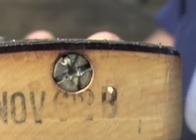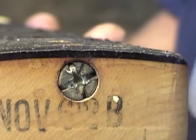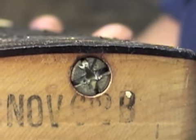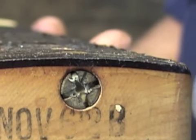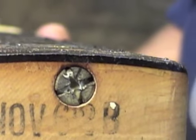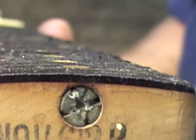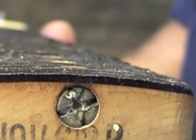Now wood changes shape over the years. This fingerboard was flat in 1962, but under string tension maple really changes shape. So the secret of a great fret job is to have a flat fingerboard with the truss rod off. As you can see, there's no fingerboard on these real Fenders, so you can't really level the fingerboard to get the action perfectly right. So what I'm doing is putting on slightly oversized frets and then leveling the frets to get the fingerboard path perfectly flat.